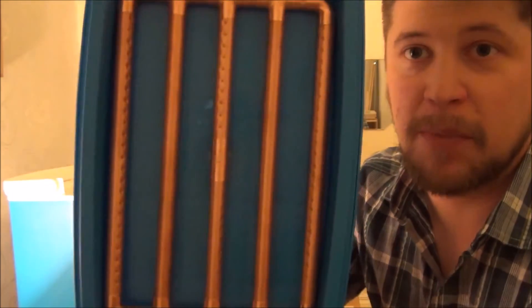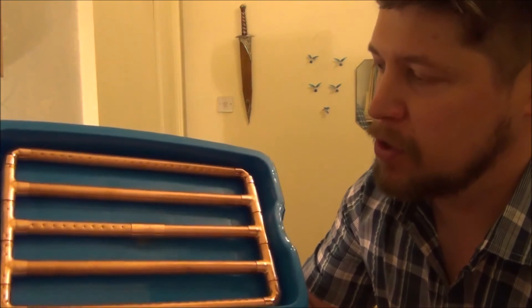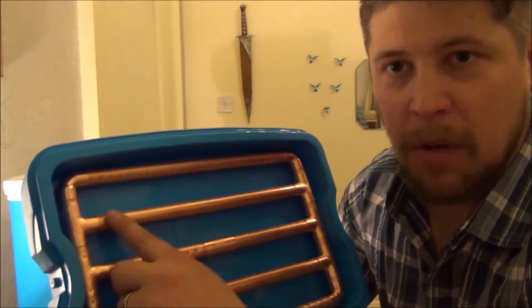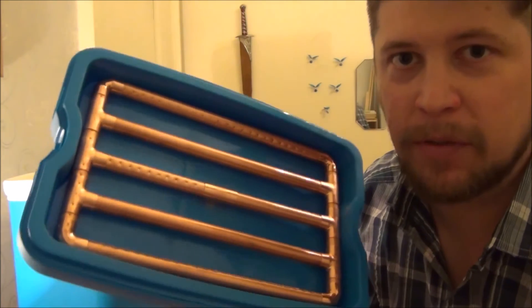The sparge arm is finished, all put together with the extra bars in, and I think it's definitely worth doing. It's going to give a much more even sparge rather than just a bit on the edges and a bit down the middle. I've just got to mark these up for the holes, tap the dents in, and then we'll go downstairs and drill the holes on the pillar drill to make sure they're nice and straight, square, and controlled. We'll see you downstairs.